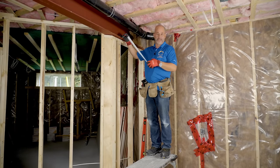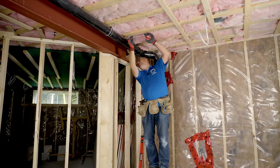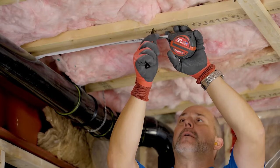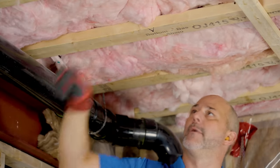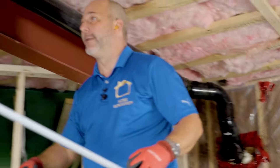Because we're dealing with steel and engineered floor joists, everything is already perfectly flat. We're just going to measure off with our tape — and we're going to measure off from the steel, not the wooden plate above the steel, because that'll come and go. We're going to go to 24. I'm going to make my mark right here. That's how you make a mark: make a V, because the tip right there is the measurement. We're going to come down here and do it again.